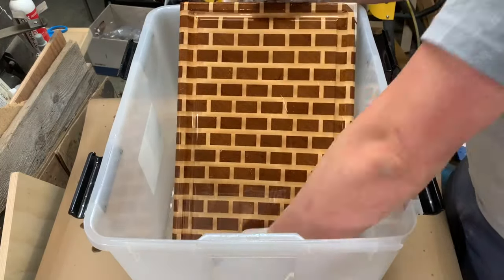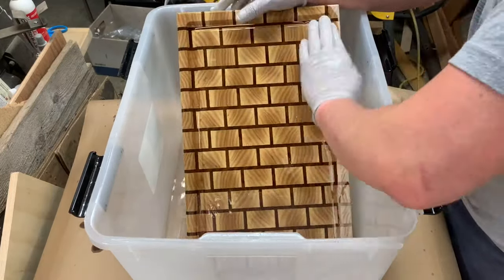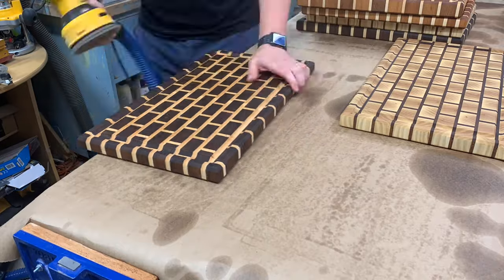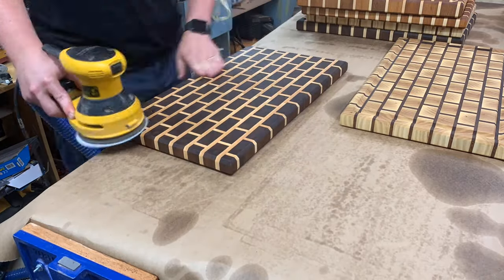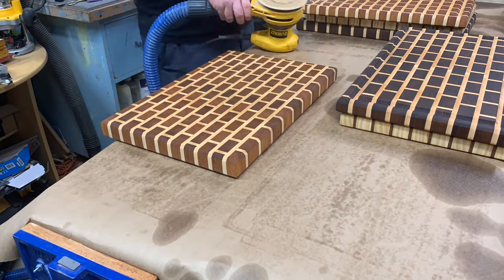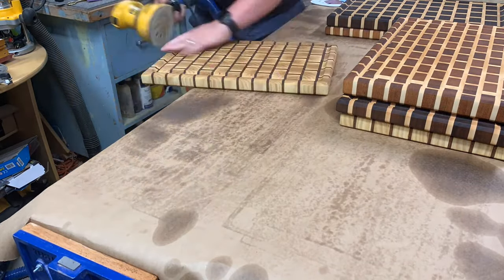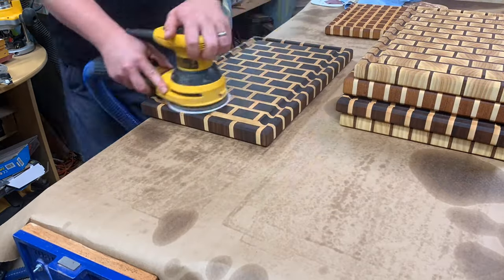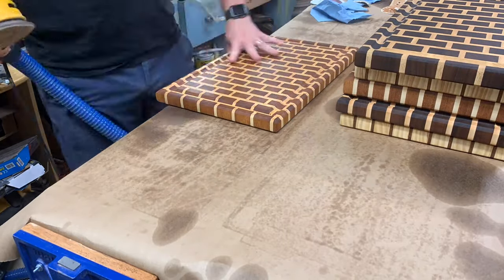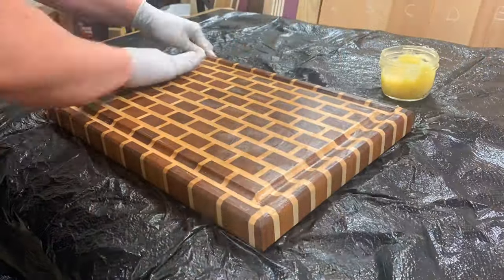After mineral oil, I added a step: once it's dry it's still a little rough — it raises the grain again — so I go at 320 to knock down those fibers. A tip from Moose Works on Instagram. Then a little more hand sanding to finesse it. I just let the weight of the sander do the work, barely touching it to knock down those fibers and make it silky smooth.